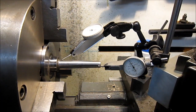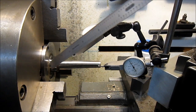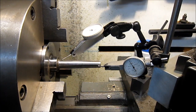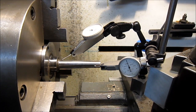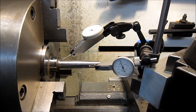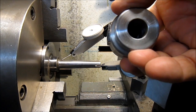So a little story here. In the lathe I've got a tailpiece that mounted on a chuck for his Stark lathe, the backing plate. It's a one piece. Chewy had turned this portion down so that he could put it in a collet. And then of course here is the taper for the Stark lathe tailstock. So I was indicating the back of the tailstock there so that I could pick up the taper. And the plan is we're going to build a new tailpiece for the two jaw chuck.